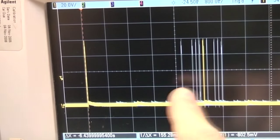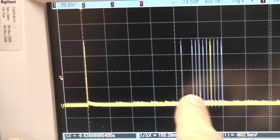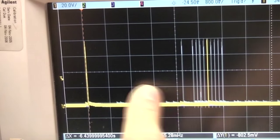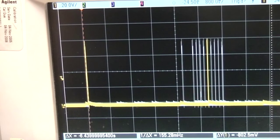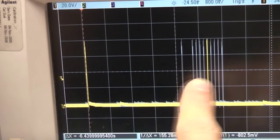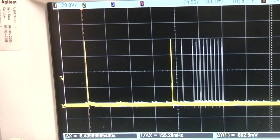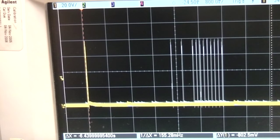Leaving it running for a minute you can see it seems to be picking one of a set number of delay periods, so this short period is maybe the wake-up interval. If you wanted to try and game this meter by only pulling gas at certain times you'd probably have to sense the ultrasonic pulse and then make sure you only turned on within this window, because it does seem to be a fairly fixed window. This is about power management so you don't run the battery down. I don't know whether maybe this sampling frequency might change depending on whether it's seeing a higher flow rate.